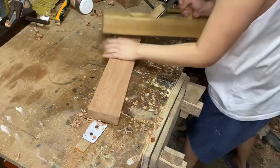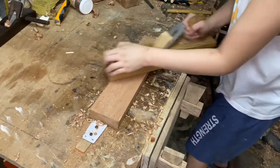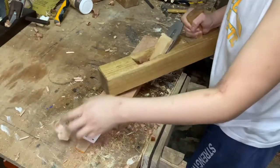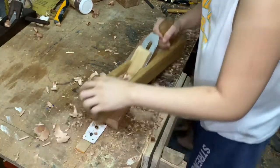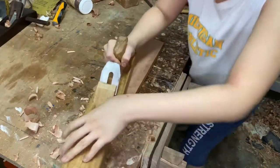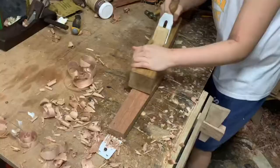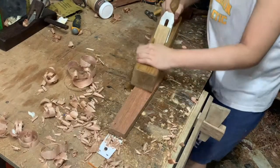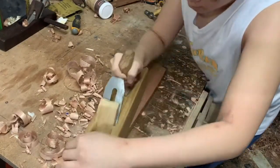Here's me just face planing a 2x4. I don't have any hardwoods, but I'm pretty sure it can plane hardwoods. As you can see, it sometimes gets stuck at the end. Earlier I was just taking too big of a shaving for a 2-inch blade to handle. Because sometimes if you see scrub planes, their blades are thinner. And this iron is cambered, but I'm not sure if it's cambered that well.